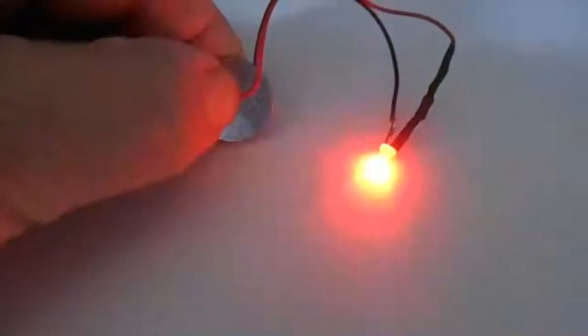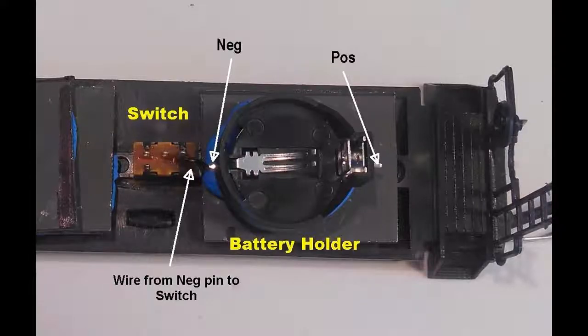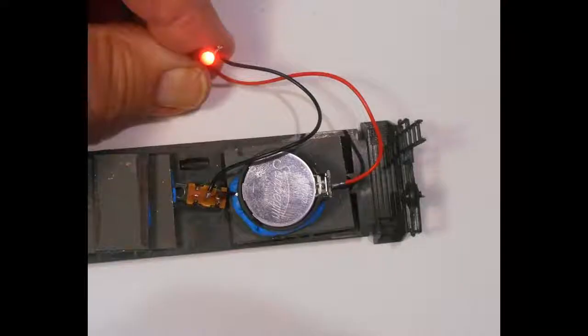A small piece of wire is cut from the black wire, stripped, tinned, and soldered between the negative pin of the battery holder and the closest end pin of the switch. The red lead is soldered to the positive pin of the battery holder, and the black lead to the middle pin of the slide switch. Once complete, insert the battery into the holder and test the switch. The battery can be removed by squeezing the connection on the positive side of the battery holder.